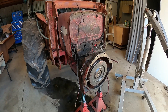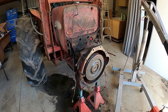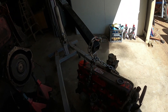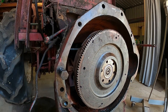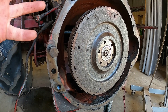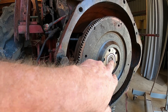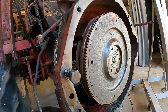This is also going to be the hardest adaption I have ever done, and I've done many - we've bolted V8 motors onto Volkswagen gearboxes for beach buggies. These motors are often put into Land Rovers, which I did with mine and made my own adapter kit. The problem here is I've got the flywheel off the Holden motor sitting on the input shaft - fortunately the clutch plate has the same spline, so it needs to sit in the correct position to pick up on the spline and have the input shaft inside the carrier bearing.